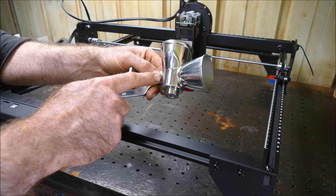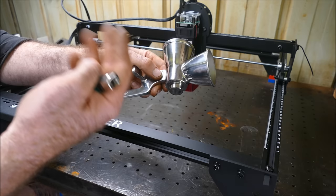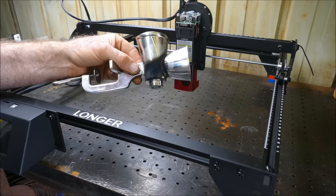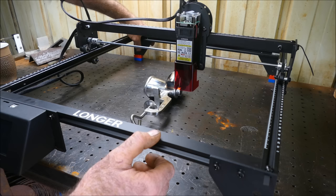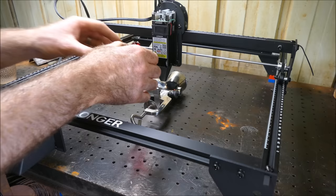For this next test I'm going to use the Wi-Fi function. I've got this shiny piece of stainless steel — a grain grinder — and I'm going to test by putting my maker's mark on it. With shiny material it's a good idea to have some blacking so you don't get reflection back up to the laser. My technique is to soot it with a lighter, just holding it on the edge of the flame to put a nice layer of soot on. I'm going to reduce the speed to 200mm per minute and it'll be interesting to see how it copes on a curved area.